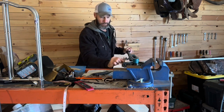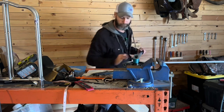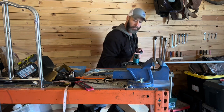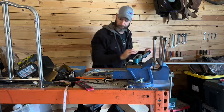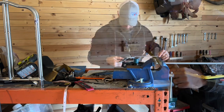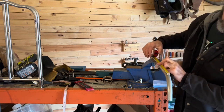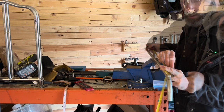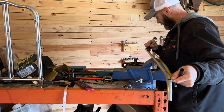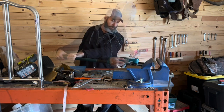You want that tight to make sure you don't get any warping. That's close, but we also have to factor in spring back, so I definitely don't want to go too far. All right, that's good. I'm going to mark that so we can use this one as a gauge for the next one. It's really 32.7 — almost 33 — but we don't need to go much further.